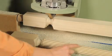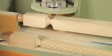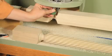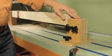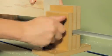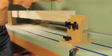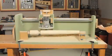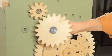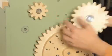The next step is to round the leg and create a taper at the same time. To do this, I'll install a bowl cutting bit in the router, and then I'll raise the bottom of the leg by adjusting the tailstock — this creates the desired taper. To move the router along the leg and rotate it at the same time, I'll install a gear to connect the indexing wheel and the drive gear.